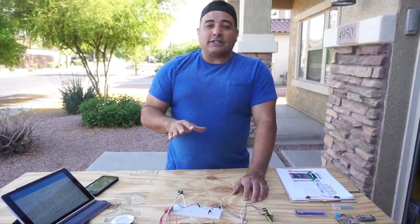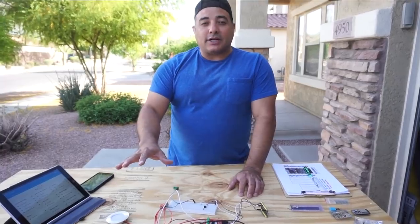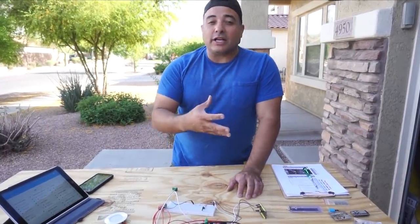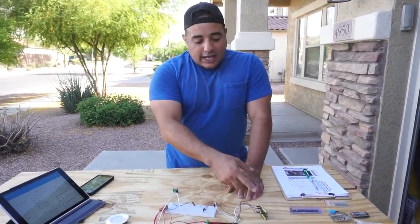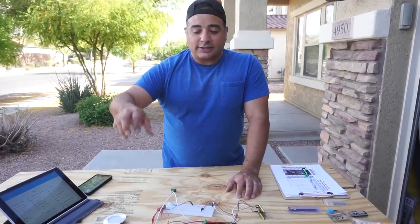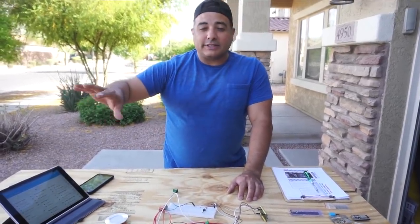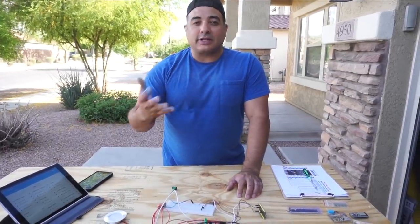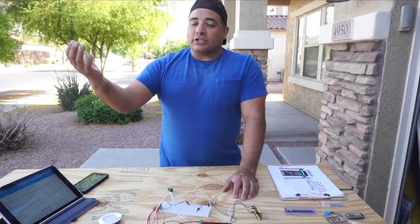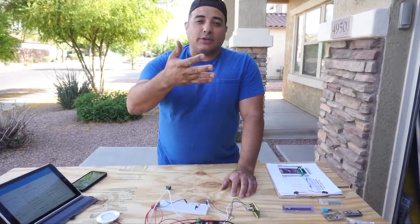And so what that gets us away from is, when I hit the switch to turn the lights on, it doesn't have to make an internet, or even a local network, connection. It just talks to the processor running directly, which then turns on the lights. And then after those lights have turned on, it notifies Home Assistant or anybody else who cares that the lights are on. So that's a little bit different of a scenario than a switch that only knows wireless and speaks MQTT.